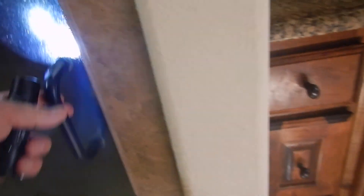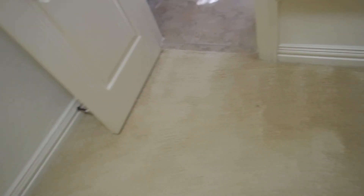This door swings both ways. It's okay for it to swing inside, but it has to be able to swing outside — that's the requirement. You can lock the primary bedroom front door, the door to the patio. But on the back side, coming through the closet and the laundry, you can't lock that.